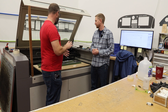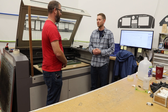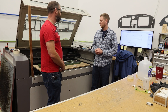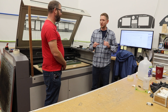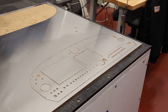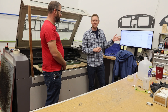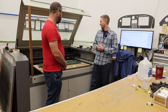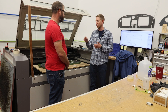What's the process of going from a design file — obviously the design itself is done earlier in the process, and we worked with Nick a lot back and forth getting our design set up — but how does it get down here into this computer and eventually onto the panel? We have the files on record in our customer files. Once we get the panel design, it's turned into a cut file, which is just the cut lines, none of the graphics or other details. Then it's cut on our CNC machine, then it gets painted. From there I'll take that cut file, put the graphics back on it, and convert that into a program that the laser CNC runs on. I'll have it either cut the graphics or trace the graphics either way.